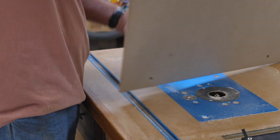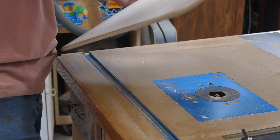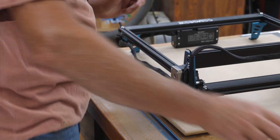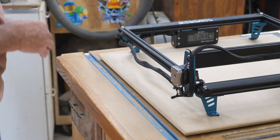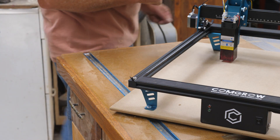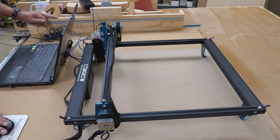Now it's just a matter of turning the board over, setting the T-nuts in their spots, and with a hammer, just driving them in. I put a little F on there for the front so I don't get this backwards. So, set the laser back in place — I'm using some quarter-20 hex head by half-inch bolts.